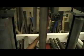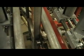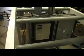Here's where the key information comes in: how fast you feed the wood into the blade to be efficient but yet not snap the blade, and how fast you run the blade — blade speed. This particular pallet blade is designed for a maximum of around 2,000 feet per minute. We've designed this saw for half that — 1,000 feet per minute — figuring that if we hit a piece of metal at 2,000 feet per minute we would pretty much snap the blade. We installed a Mitsubishi frequency inverter, an A200, which is capable of powering a seven-and-a-half horsepower motor. This frequency inverter gives us the ability to control the speed of the motor, and what's also nice is we can feed in 220 single-phase into this inverter and it outputs three-phase, which is a real big advantage.